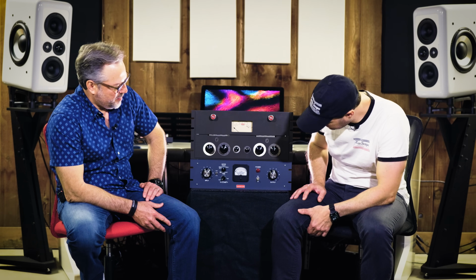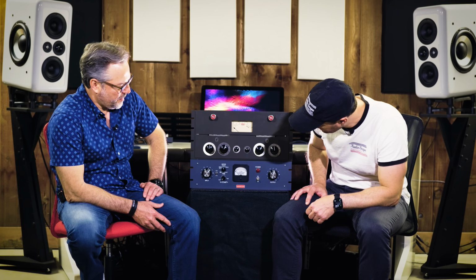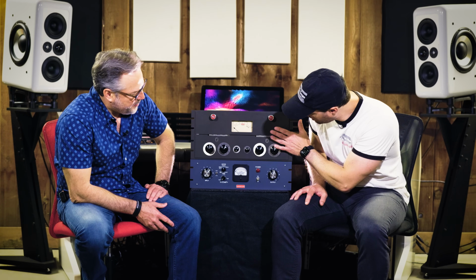It's a classic sound. This one is so similar to a Fender Tweed, it's not even funny, in my opinion. Really? It's a lot of those same tubes. It uses a 12AT7. It's also got the compression tubes, the 6386, the 6AL5. We even use the rectifier tube, the OB2, which has a lot to do with the metering of the unit. But I know we've spoken a lot about this.